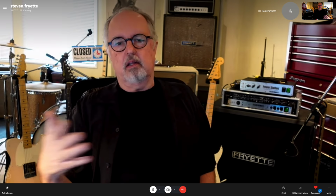Mm-hmm. And you know that the Syn 1 and Syn 2 have a feature on them that allows you to use that box to add channels to an existing amp that you might have that has an effects loop, right? Okay, so you have a little combo amp. Maybe it's a single channel amp. Maybe it's a multiple channel amp that you don't like one of the channels or whatever, but at least it's got an effects loop. So what you do is you put the Syn 1 or Syn 2 on top of the thing and you hook it up in the add channel configuration. And now you can footswitch whatever module channels you have in your system into the effects return of your combo amp, thus expanding its usability and range of sounds. Great. Cool little feature.